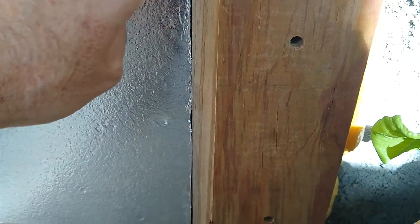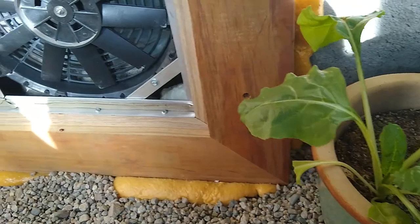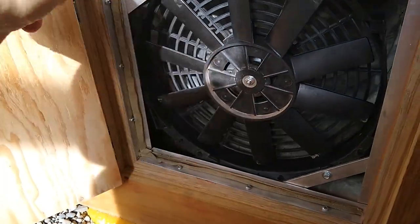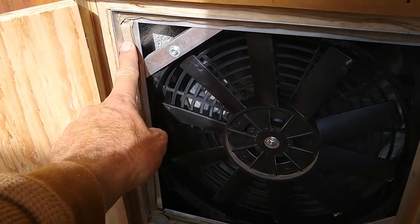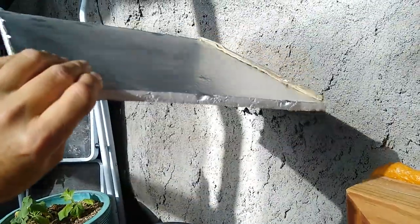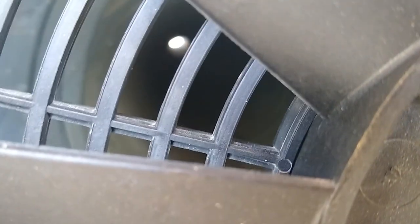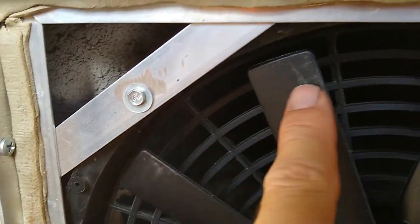This little piece of half-inch insulation I put in here to block cold air — even with the door closed the cold air coming around the edge was crazy, especially when blowing from the north it would actually blow the door open. So I put mobile home butyl rubber tape folded over to make a seal all the way around for this half-inch piece of insulation. That sealed it up really well. What I did not do was plug the other end of the culvert — it's two 20-foot culverts banded together, 40 feet down there — so cold air is still coming up that tube, pulling heat off my thermal mass and tire bales around the culvert.